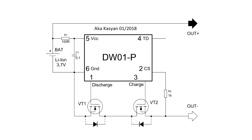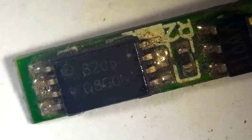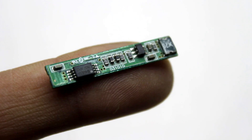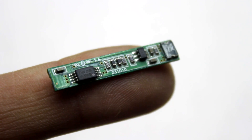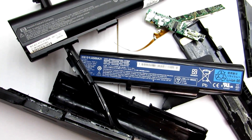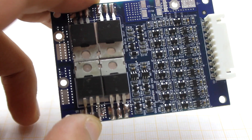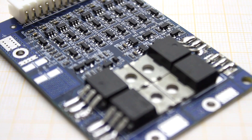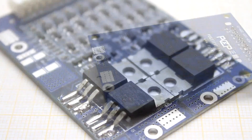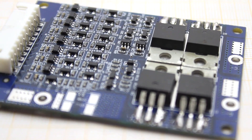The microchip tracks the voltage drop across the transistors through the second pin. I've explained the principle of the simplest protection board for one lithium battery cell. There are more complicated circuits — for example, in laptops there are smart chips that control each battery. There are also those which can control 10 to 12 cells at once and provide huge discharge currents up to 100A and higher. Such controllers are used for small solar power stations or electric transport.